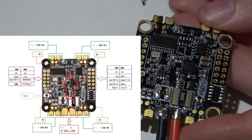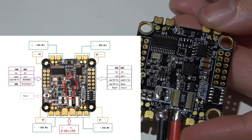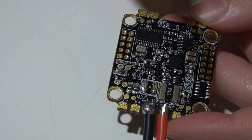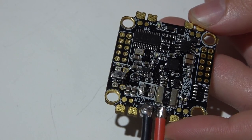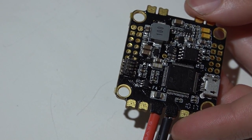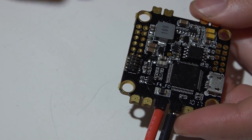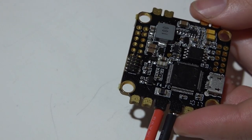On the left side of the board you'll see UART6 receive, and the pin to the right — which has some strange writing — I can confirm is UART6 transmit. If you're using a Spektrum satellite receiver, there is no dedicated 3.3-volt pin, though there is 3.3 volts somewhere on the board since every flight controller has a 3.3-volt regulator to power the processor. You may have to break out your voltmeter and probe around until you find it.